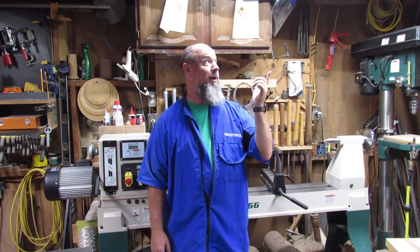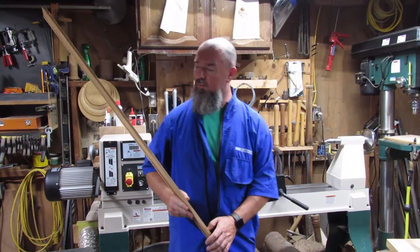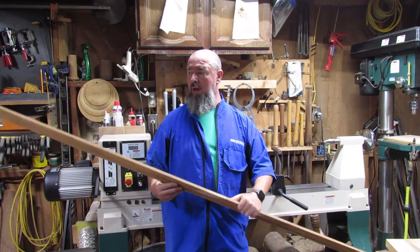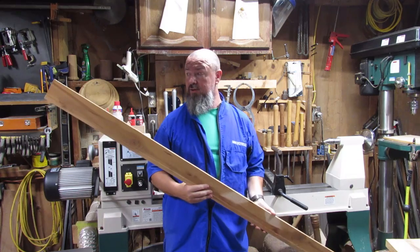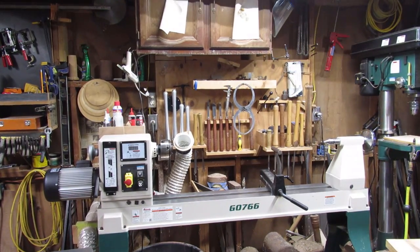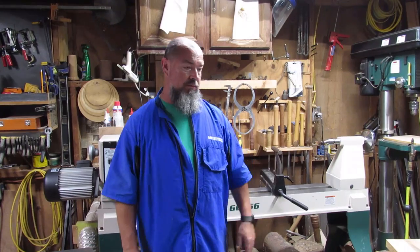But I'm going to be doing that and my camera trolley. My camera trolley actually fell. And this was it, right here, or at least part of it. It was a 2x4 that I had re-sawn, and I had part of it down on the bottom like a T. And it held up for a long time. It was up in the ceiling like that, and my camera just rolled along it. But the next one I'm going to build out of steel, and I've already cast new wheels for it so that it can roll nice and smooth. They're on bearings, and I cast little epoxy wheels with V grooves so it can roll along that track nice and smooth.